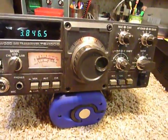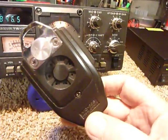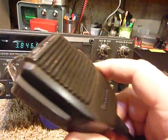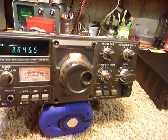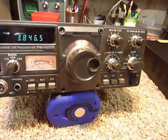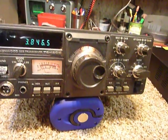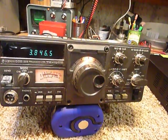The first thing I found was in the microphone — there is a screw there with a little clamp on it that holds the microphone cable, and under that little screw was the hot wire from the microphone. This thing operated intermittently; sometimes it would transmit, sometimes it would not on sideband, and that's because that screw was shorting out the microphone wire.